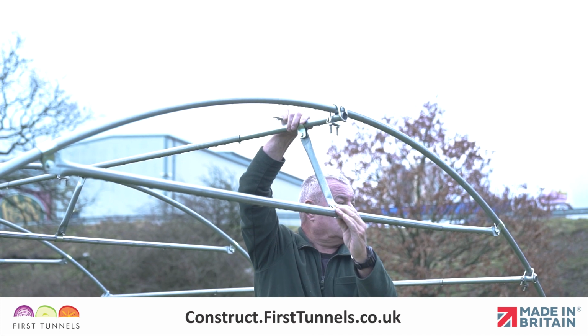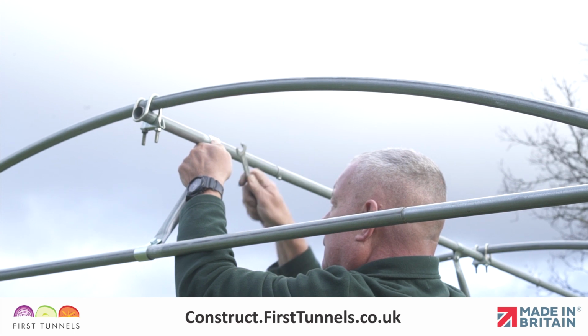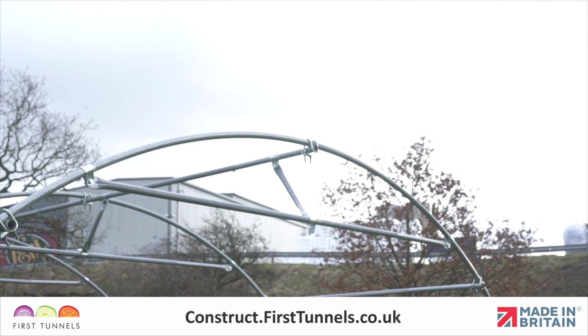Adjust the Q-clip so that the door rail is level and the diagonal brace is not pushing the door rail down nor pulling it up. Then firmly tighten the Q-clip. Repeat this process to fit the door rail on the opposite end of your polytunnel.